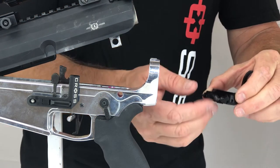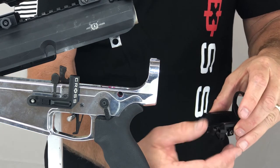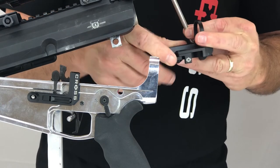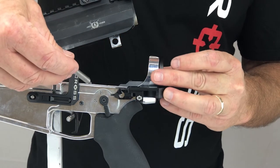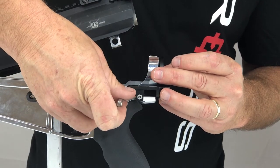Please take note of the directions of the quick pins assembly as you remove them from the quick pin assembly body. Next, we need to install and align the quick pins to the firearm. Take the quick pins assembly with the supplied alignment pin and place the assembly on the back side with the alignment pin through the rear takedown pin hole.